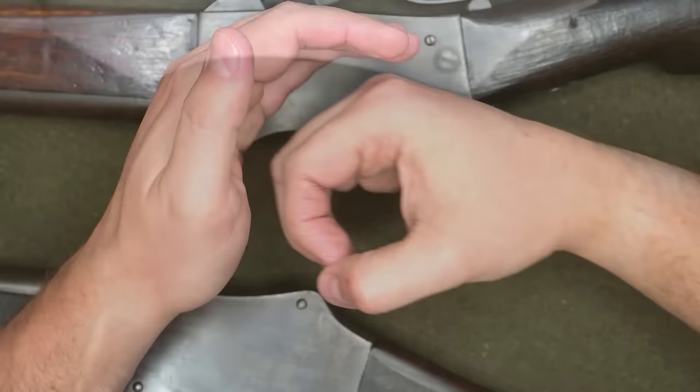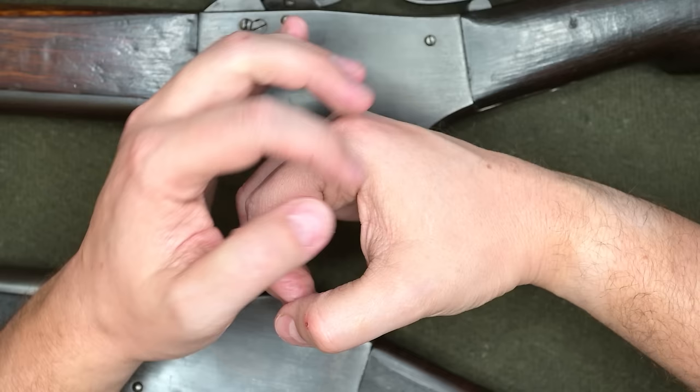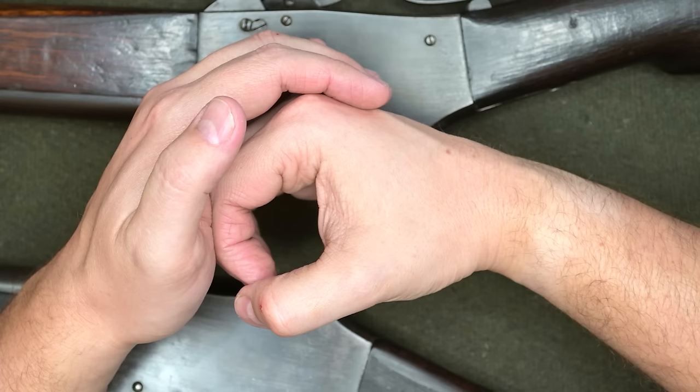The idea being that this is where our locking strength comes from, not from whatever is in the hole, being the pin. Unfortunately, if these get separated, then anytime we have extreme recoil, the pin, what is through this hole, is going to be what takes that impact, and eventually it'll deform until we make contact here, which means you have a lot of these guns that show signs of bent pins.